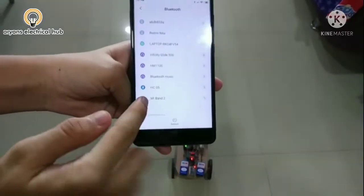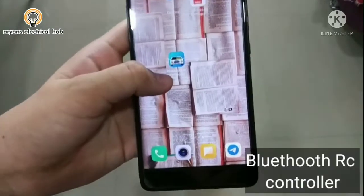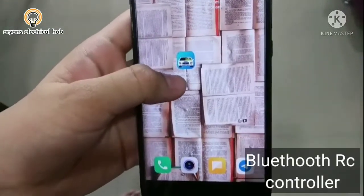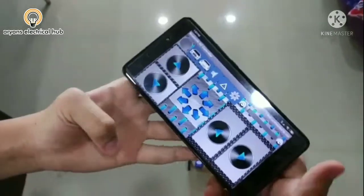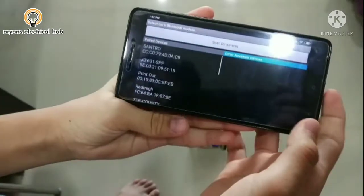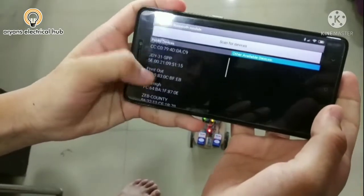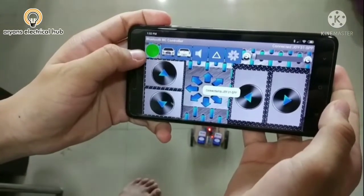Here you have to pair one device, HC05. You have to download one app, Bluetooth RC Controller. I will give you the link in the description to download. You have to open it, then click on settings, then click on connect to car, and then choose HC05. Now this has become green, so the car is connected.